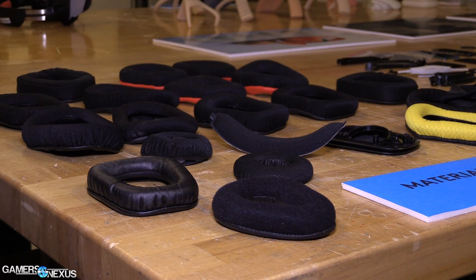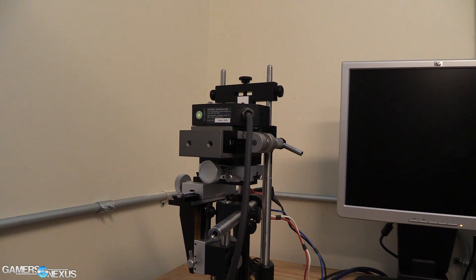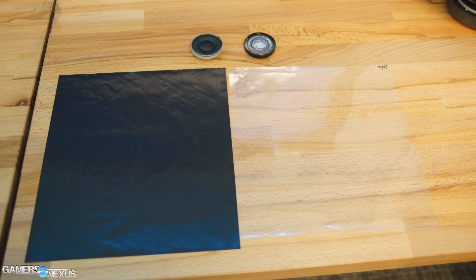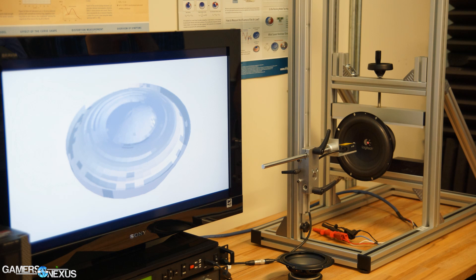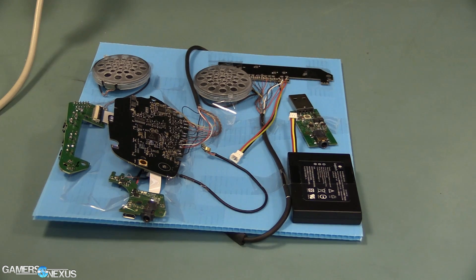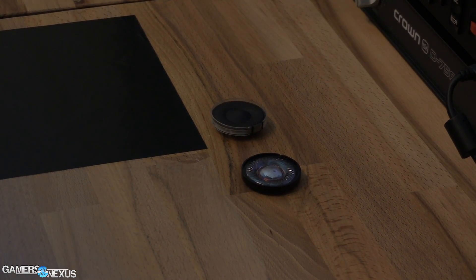Why is it different than the previous drivers? For Artemis Spectrum, we really wanted to bring up the performance of the audio, and you've got to start at the heart of the system, which is the driver. For the Pro G driver, we focused a lot on what we call the diaphragm — that's basically the material in the front that moves and vibrates to create sound. You need a really light material because it has to be easy to move, yet light materials are not very strong, so they can bend. When it bends, you get distortion and the sound isn't accurate, and eventually it can't push air forward at all. The engineering behind the Pro G driver was really taking the material that's usually just a sheet stamped out in plastic and weaving it instead, so that you have a cone that's just as light but better able to move without breaking up, bending, crackling, and distorting.